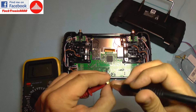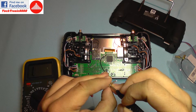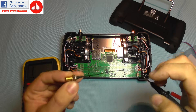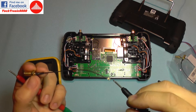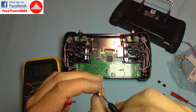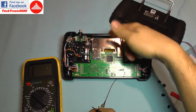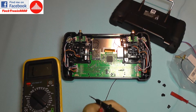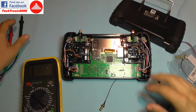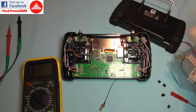You can also check it for short circuit by checking the middle together with the outside — if it does not beep then it's not in short circuit. But the main problem here is that the middle of the connector will not have a closed circuit with the middle pin, which means the transmitter will not output the signal to the antenna. So you have an external antenna for nothing and you get a very limited range.